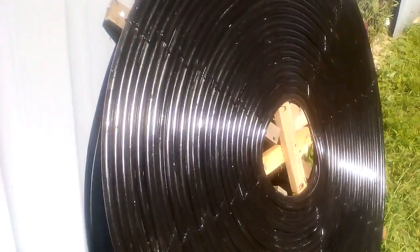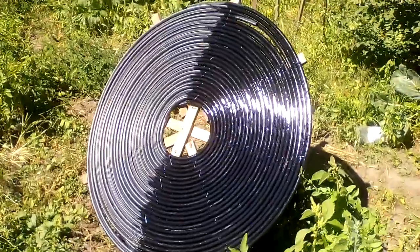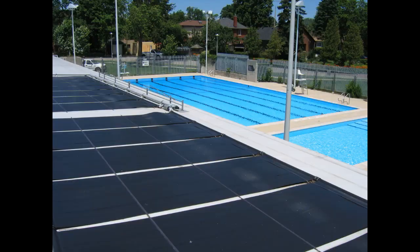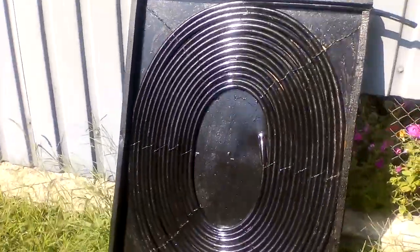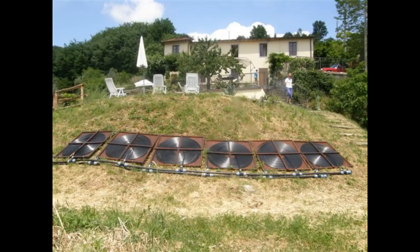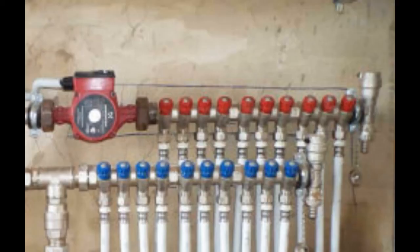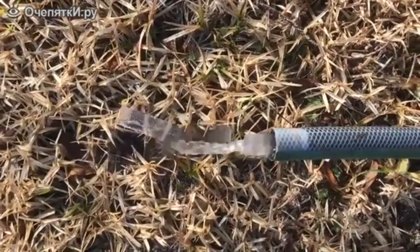The type of solar collectors in the Irish project is intermediate between two cases, closer to the case with small gaps between adjacent pipes. Two kilometers of those pipes form solar collectors on a total area of 50 square meters with specific energy parameters — almost two times worse than expensive solar collectors for swimming pools, and about 20% worse than cases where pipes are laid on a black surface. All solar collectors use one pump operating about 700 hours per year during sunny hours, sometimes in cloudy weather, and very rarely on warm nights. The pump takes water from the bottom of the tank, then its flow is divided into 10 to 20 parallel flows, each going through 100 to 200 meters of solar collector pipe. Thus, the solar collectors use water, not antifreeze.